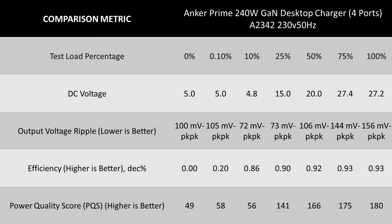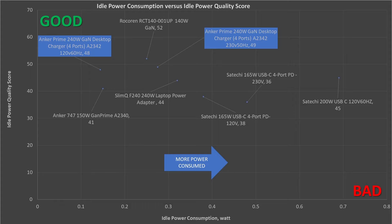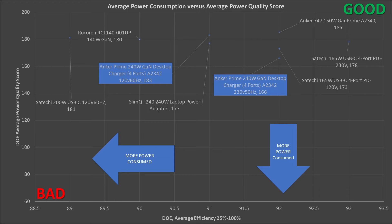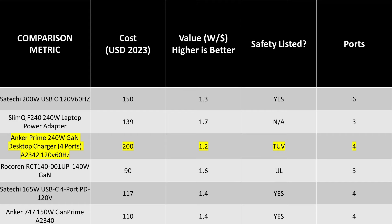Time to compare some numbers now. Looking at the idle power data for this thing in comparison with others of the higher wattage variety, this thing does great. For 240 watts, it's the class leader — like no comparison really. This means the power supply is really relying on the storage of that little auxiliary capacitor too — every once in a while it draws a little pulse. At 0.1 watt out, it increases to just 0.4 watts in. This is like leaving an Apple Lightning cable plugged in. The idle runs a bit high on 230 volts, so it would struggle with the EU specification, but no one else in this class is good either. In terms of average performance, this adapter's average efficiency — specifically looking at the DOE6 efficiency, which means 25 to 100% load — this power adapter does great. It is a top tier performer. This is plotted versus power quality, which is just too much for one video. To put it simply, it's also very good.